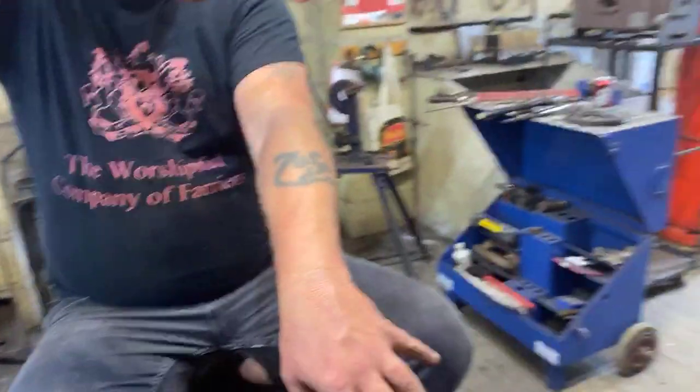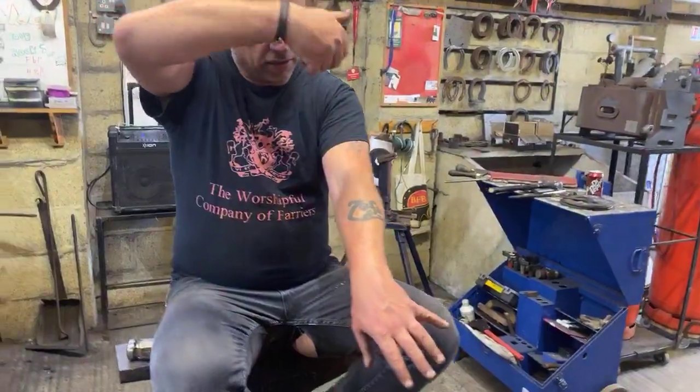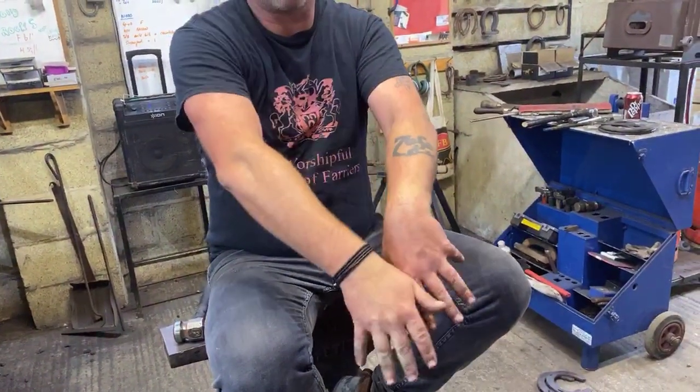Secondly, like I said this morning, I want you to make a shoe, again out of flat or concave. Bearing in mind, scalping tends to happen more on horses racing on turf, so you're best off doing it out of concave. But I want to see a shoe, if you had a horse which was scalping, that you would perhaps try to stop it from injuring itself. So work it out. How are you going to reduce the damage the front foot going down is going to do to the front of the hind fetlock?